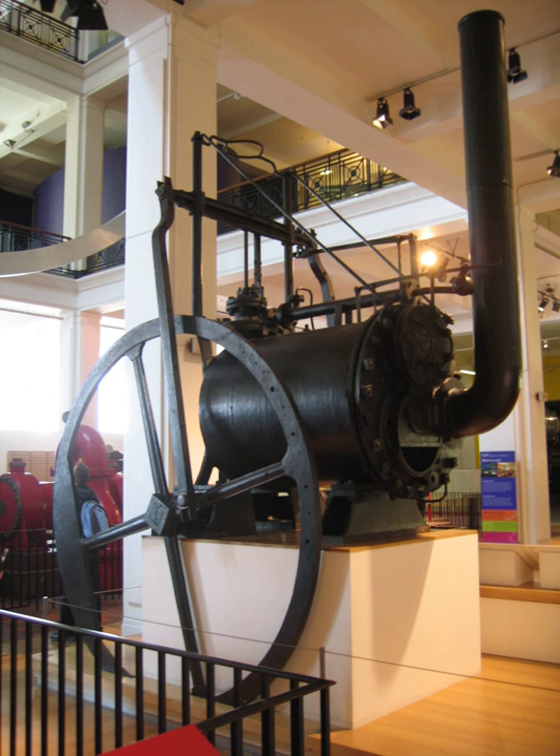By the time of Stevenson's Rocket, particularly as the new fire tube boiler locomotives became lighter and faster, it was recognized that vertical cylinders caused hammer blow on the flimsy fishbelly rails of the time. Rocket was built with cylinders inclined at 45 degrees but was soon rebuilt to place them near horizontally. Since then, almost all steam locomotives have had their cylinders placed close to horizontal.